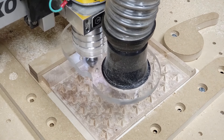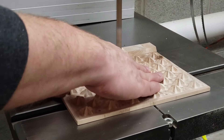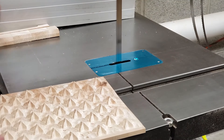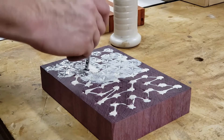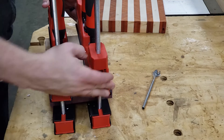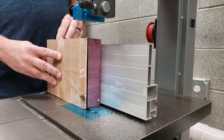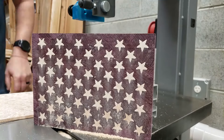If you'd like to see a more in-depth video on how I do inlays like this, please leave a comment down below and let me know. Next I cut off the waste using my band saw — you can also do this with a table saw if you wanted to. Then I add glue to the negative space, making sure to get good even coverage, and press the positive into the negative applying firm even pressure to ensure everything is glued together with no gaps. Once the blank is dried, I just use my band saw to cut off the top and reveal the inlay.